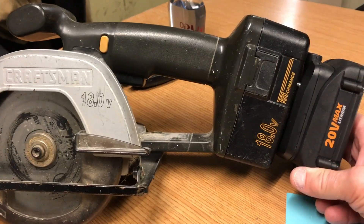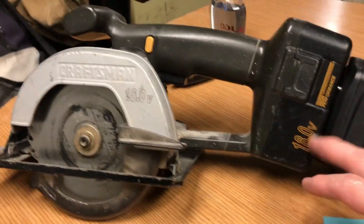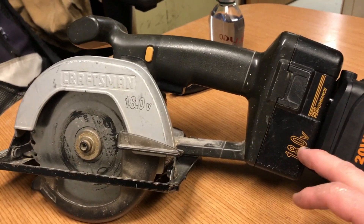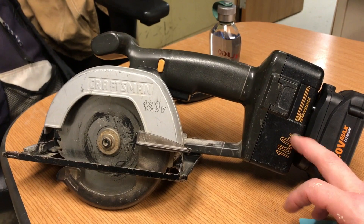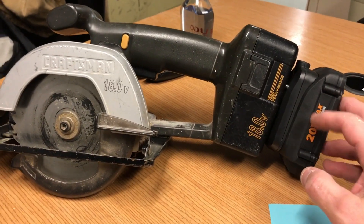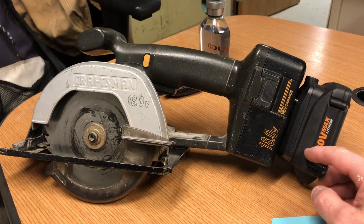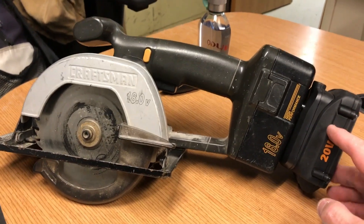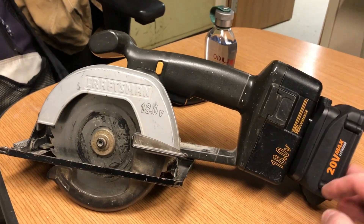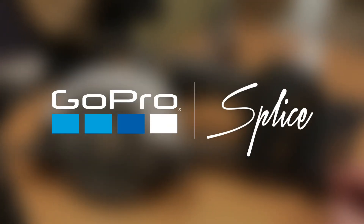Those 20-volt batteries are fairly cheap, so why not give it a try? This is a good little trim saw — why trash it just because the batteries are hard to come by? I like the newer lithium technology better. I didn't see the point in buying Chinese NiCAD batteries. Lithium doesn't gradually die — it will just shut off at the very end with no gradual performance decline. There's no situation where you're trying to cut a two-by-four and it slows down on you.